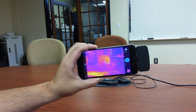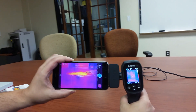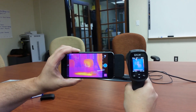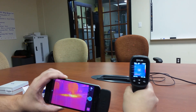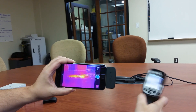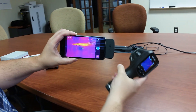It does give you only center spot measurement, which is one of the similarities between them. But you'll notice side by side, the screens look much, much different. The nice thing about the TG-165 is it has a laser pointer, so you can see the outline of what you're looking at. It's also much more rugged — it's industrialized, with a much more solid feel to it.